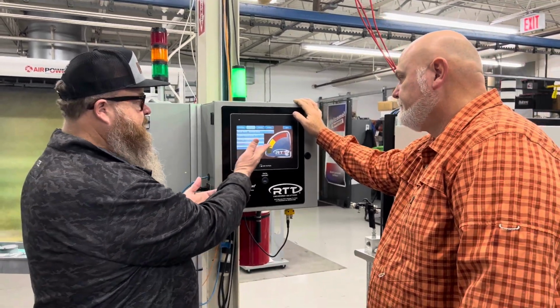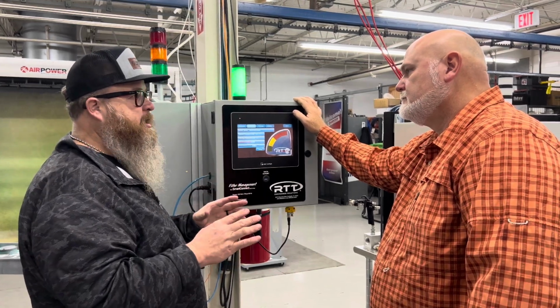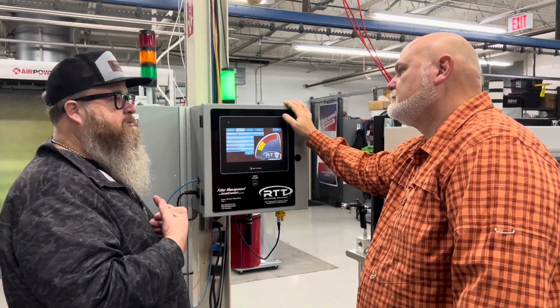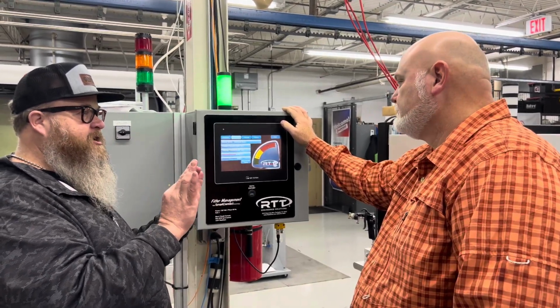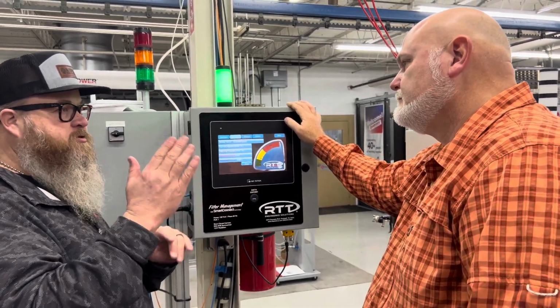Yep. So once it hits amber, way before the need to shut down, or way before the need to actually change the filters, our finishing lab manager, Jeff Tussey, and myself will get a warning email that basically says, hey, you've crossed over from green and perfectly good airflow into questionable airflow. You're getting closer and closer to that red line.